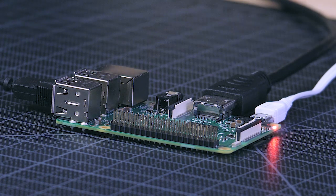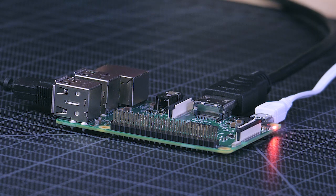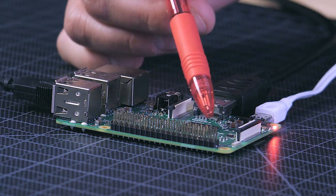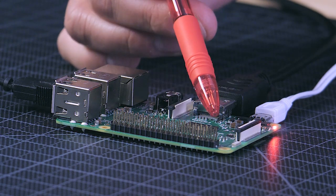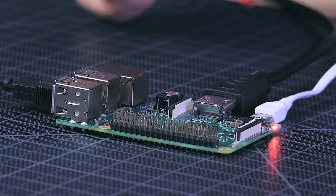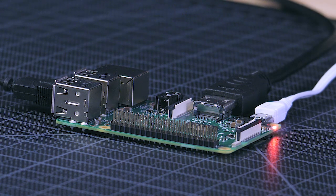If there is additional heat, that gives you a starting point for the contact measurements you're going to take. As I look at my screen here, I'm showing definitely a warm area — my large IC is definitely giving off a fair amount of heat. Is that the right amount? I don't know because I don't have a baseline yet. However, if I have a baseline, I know exactly what I'm looking at and if I do have some delta.